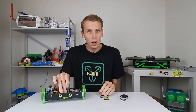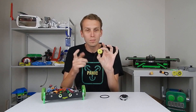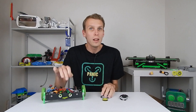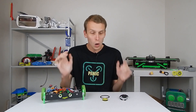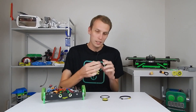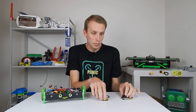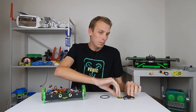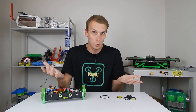I think the weapon is still going to run an ABS pulley because I wasn't having any issues with that — it was all about this weapon motor pulley that was having so many issues. I'd like to get that over to aluminium at some point in the future but I don't have enough time on a lathe. I'm going to need to lathe down these little glass-filled nylon buddies to the right size because at the moment they are way too big. But that's like a 10-minute lathe job and that's about all I'm going to have on a lathe before I go.